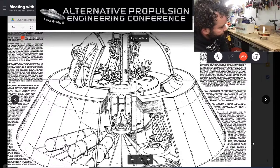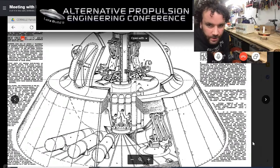It's good wire, we just didn't wind it properly. I'm thinking maybe in between each layer of windings we could cover it with Kapton. Yeah, if we just wind them in one layer at a time and just wrap some Kapton between them, it'll work very well. We don't even have to use something expensive like Kapton. We could just literally use regular tape and it would be just fine. Regular masking tape, 1 inch wide, and make a bobbin 1 inch wide to match it. No problem. Well, Kapton's not that expensive, and we have plenty of it, so I'm not too worried about that. I'm just worried about making it work.